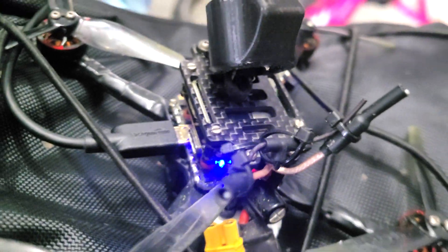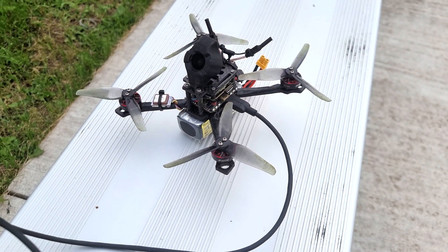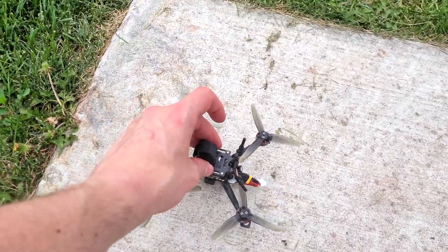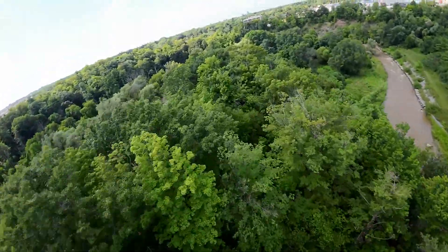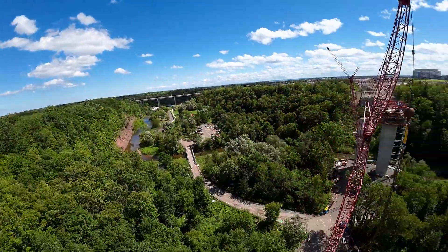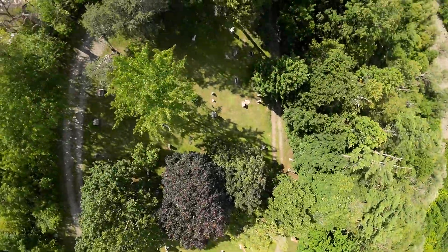Still going for the one-quad-fits-all approach, I have a connector for an optional external GPS Nano M10 module that adds 3 grams of weight, which I now mount on the arms following some excellent experiments Momobrut did with his long-range Scythe, published in detail on the IntoFPV forums. I have the GPS connected to USB power so I can obtain satellite locks with the O3 powered off, then hot-swap to the LiPo with over 20 satellites when ready to fly. The O3 is absolutely perfect for casual long-range fun flying — I can cruise around and look at stuff like a bird, go as slow or as fast as I want. The noise is so quiet that I can fly around without causing alarm, letting me explore spots I otherwise wouldn't on something larger. The GPS maintained rescue coverage even with objects overhead and re-established lock fairly quickly when pulling out of a fully inverted dive.